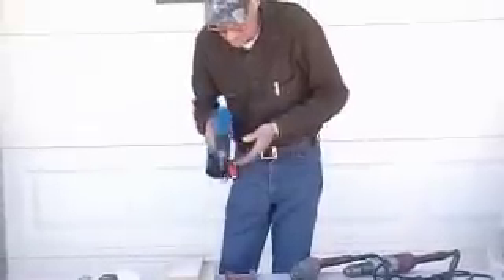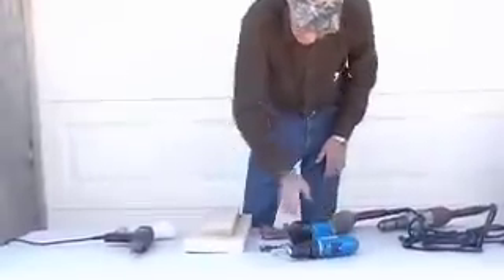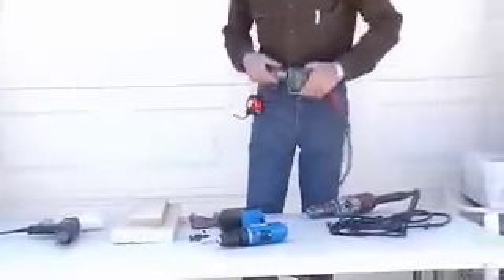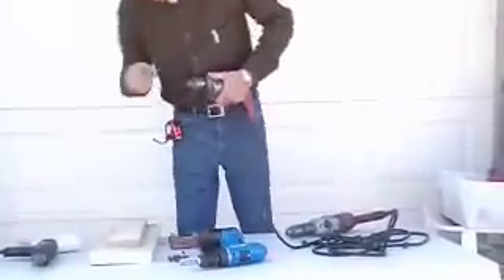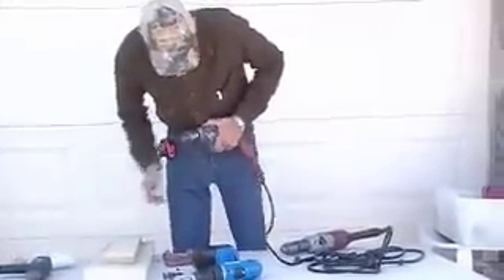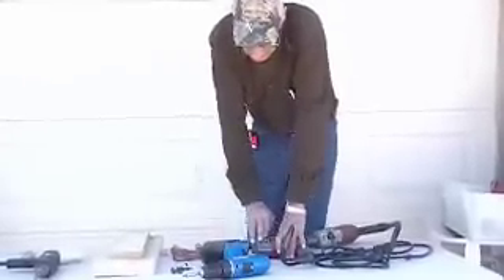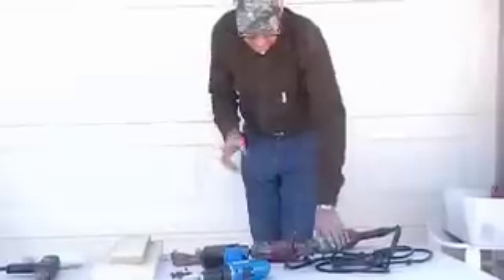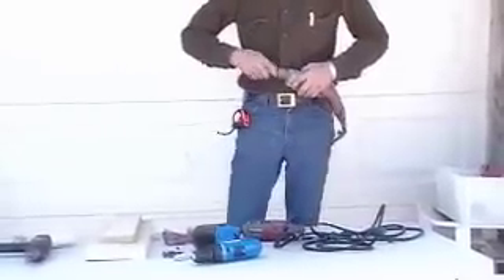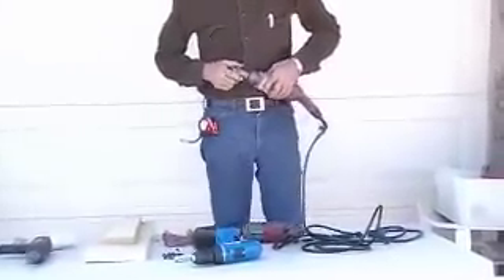You charge them, plug them back in, and they're ready to go. I use it for screwing — I'm going to show you about the screw gun part of the drill products. This is a heavy-duty Milwaukee, half-inch — it'll take a drill bit that big around, half inch up in there, so you can drill a big hole. When we get too big, we'll talk about hole saws. This one is very powerful. You don't want to bind this tool up or catch a drill bit — it'll hurt you. We'll help you learn about these tools and how to use them safely and correctly.